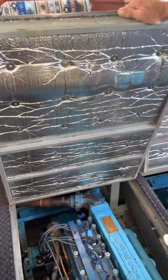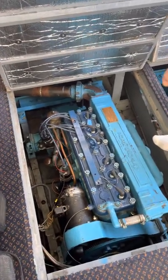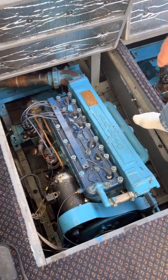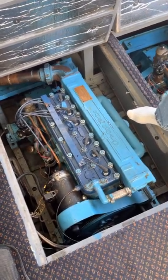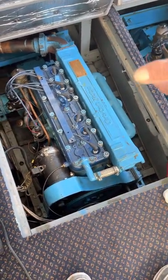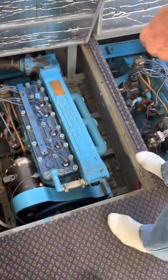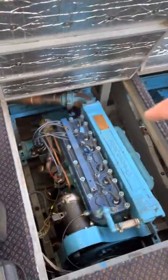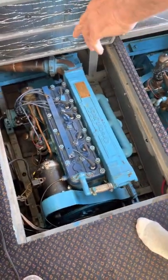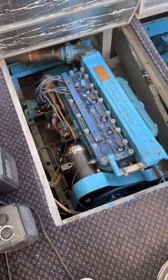All the soundproofing has been redone. The generators and starters were rebuilt. I did a lot since I got it. The heads were just done last year — starter and generators rebuilt on this one, because if it goes in the summer you lose the summer. I didn't want to wait till it went. It's nice how those heads even have the lifting clamp on them to lift them straight out — they thought of everything.